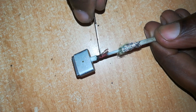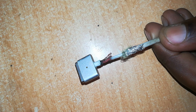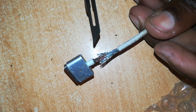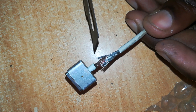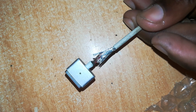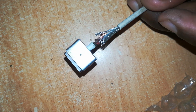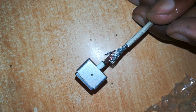Now we'll spread the negative wires over the joint. First spread the wires from the connector side, then spread the wires from the cable side over them. Both wires are ready to be joined. Someone may think we need to solder this, but it's not necessary — a little glue is enough to hold these wires together, and it doesn't stop the wires from conducting.